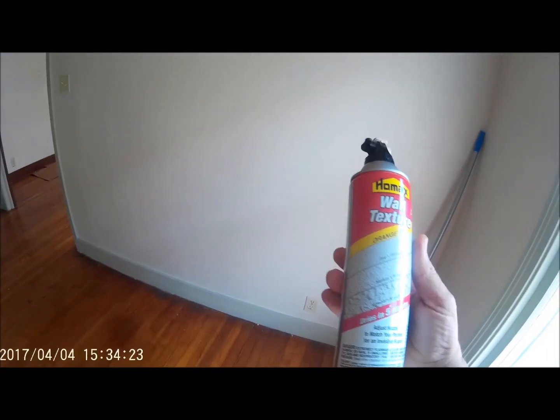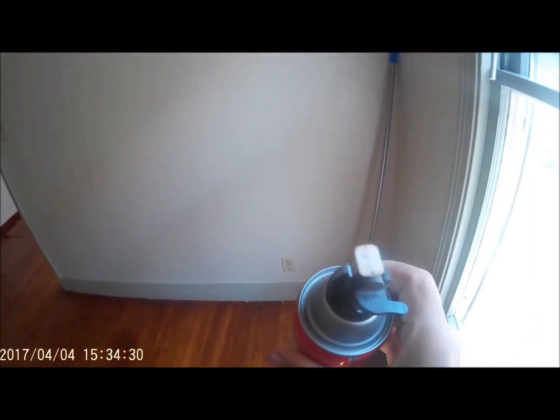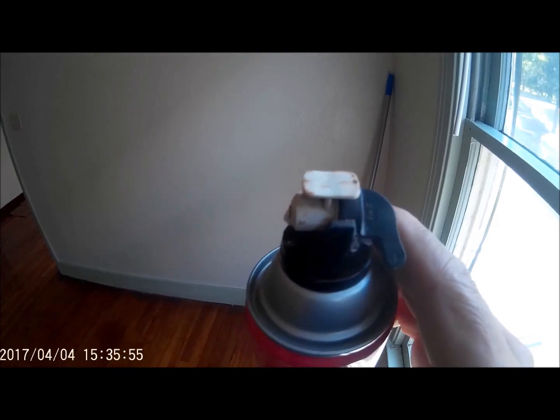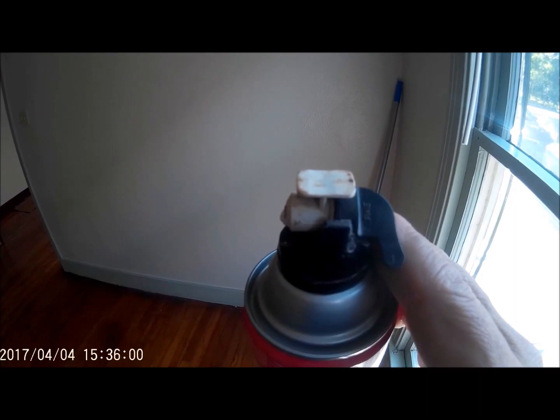And so that's about ready. Now I also like this because while it's still wet, I like to spray the texture on a surface. Here's a can of spray texture. Simple enough to use. Shake it up real well. And if you look at the top, on the very top it says heavy. If you adjust this thing, and this side of the valve, I don't know if you can read it, but it says fine. So my recommendation is much easier to keep applying more than it is to try to take it off.